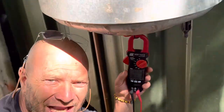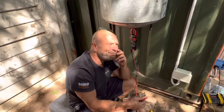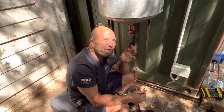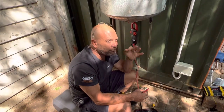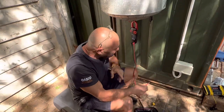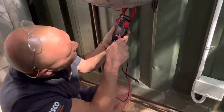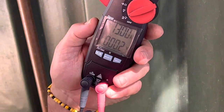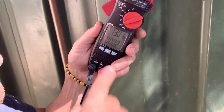Please, guys, it's not an exact science. It's just for you as a plumber to say: it's a three kilowatt element, it's approximately 4.5 amps per kilowatt — so 4, 8, 12 — but it's a little more than four, it's 4.5. So it's 13.6 according to the calculator. I'm getting just under 13, which tells me — and remember, we're not getting pure 220 volts — so don't be very strict with this.